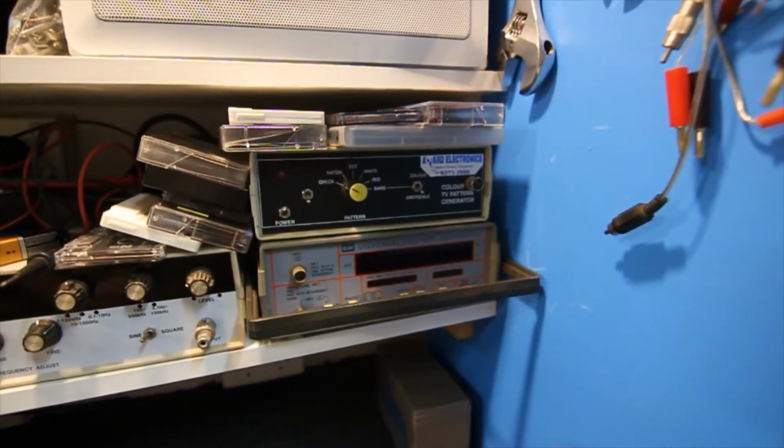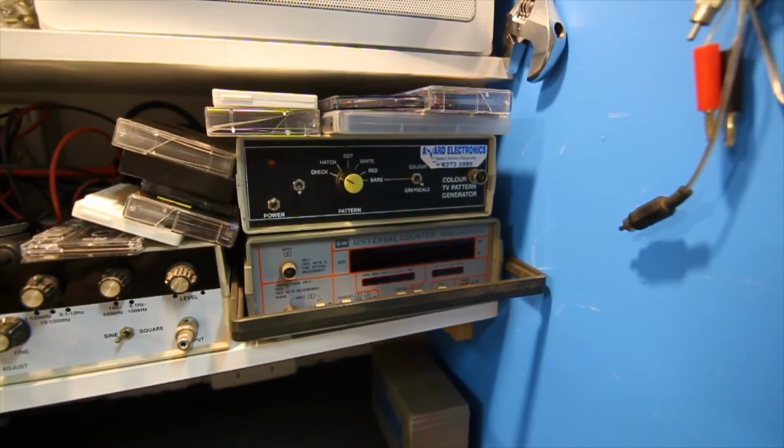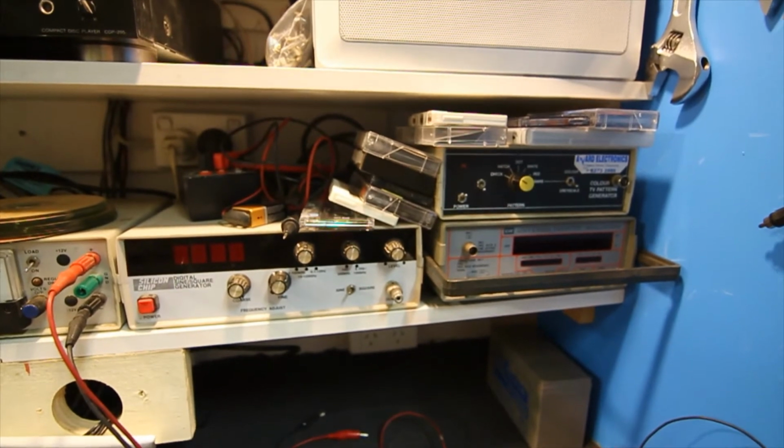and that'd do the job. And a frequency counter, that's handy if you're testing the speed. If you want to measure the speed of a cassette player motor, you can just run your 1 kilohertz test tape in there and check it on that. But again, it's pretty rare I ever used any of these things, but just the odd job you'll need them.